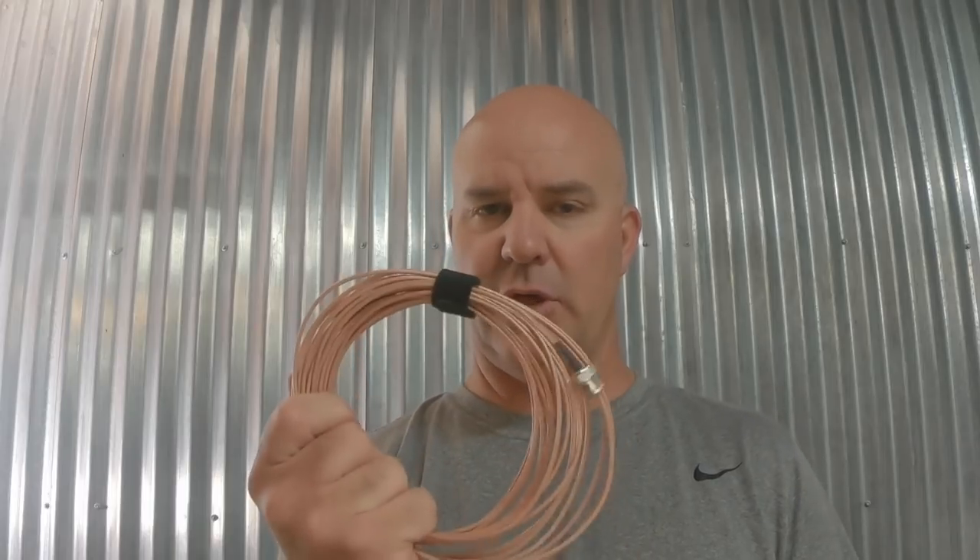Tony's going to say it's a much better antenna — it sounds better. But for my summits on the air, portability is key. I'm trying to shave as much weight as possible. The speaker wire antenna is cheaper to build, lighter to carry, and easier to fit in the palm of your hand. There are no connectors to worry about — I just put ring terminals on it, a couple of pennies each, and I can deploy it right away.